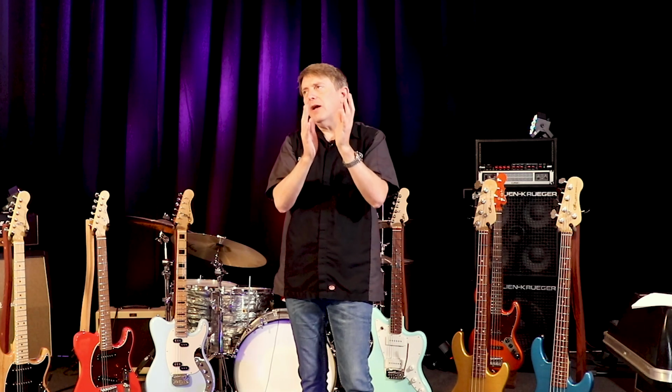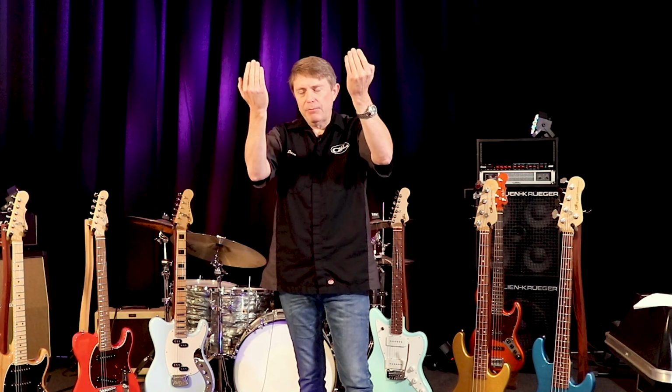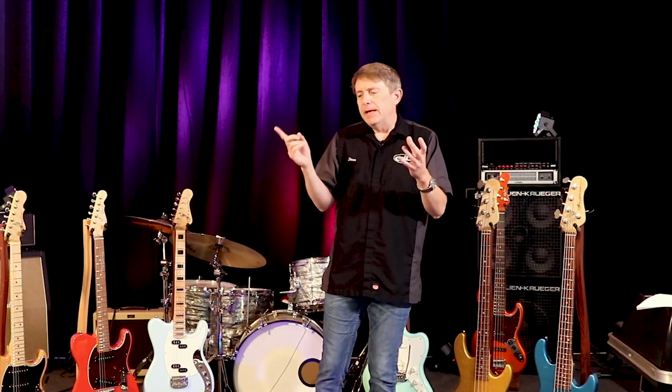So what Leo thought is, hey, if I can just create a broad magnetic field, that's provided by the magnet you see on the bottom. It has all one polarity facing up through the coil. The benefit of that is he could get more energy out of that pickup for a given amount of turns, and therefore, as a consequence, a little bit lower noise as well.